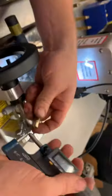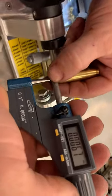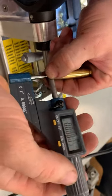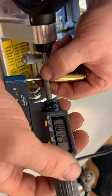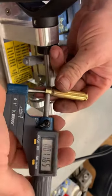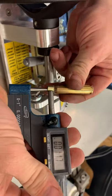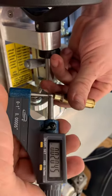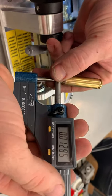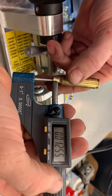Once you find a spot with the mic, there's a technique to how much you ratchet down. If you really crank hard, it's obviously going to give a false reading — it's locked on there, that's not accurate. Try to keep the same feel, the same click — do the same thing each time and you'll get consistent measurements.